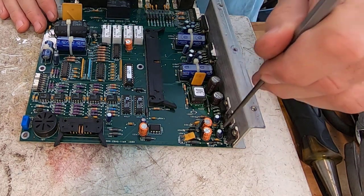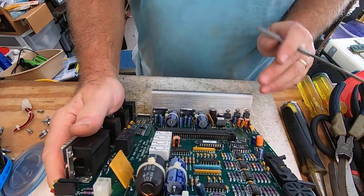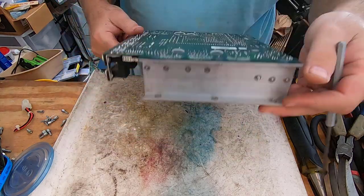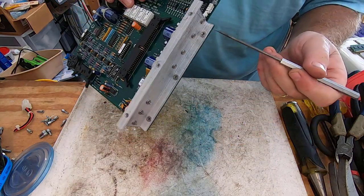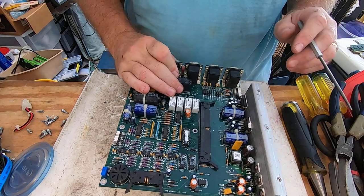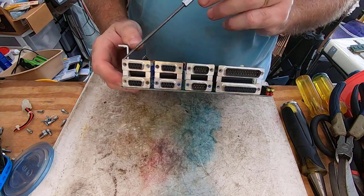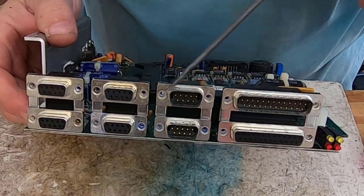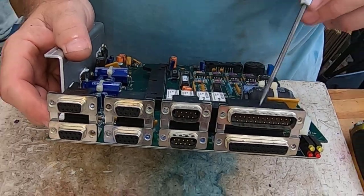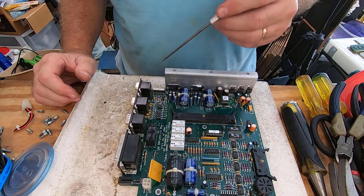This is an aluminum heatsink with FETs, all right? So those would come off by unscrewing each one of the MOSFETs, and then the aluminum heatsink is just on with some little taps there. You just knock that off if you want to take the aluminum heatsink. And then you've got these connectors here, which are clearly gold-plated pins, male or female. And then the question becomes, do you take those off and sell those as gold connector ends to board sort, which are good space fillers? Or do you leave it on?